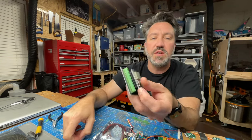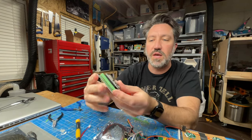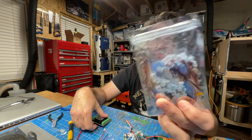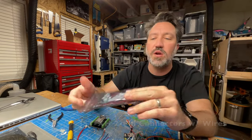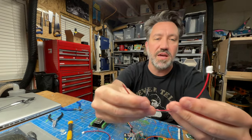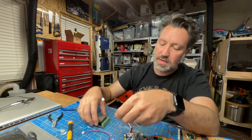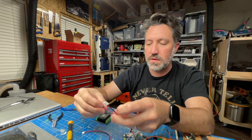The nice thing about this is you can connect to all of the various pins by simply using the screw terminals, and we're going to do exactly that. On Amazon you can get a pack of these — they are JST XH pins and pre-wired connectors, and they come in various sizes. You can get a pack of 10, pretty cheap. They're already got everything crimped, pre-soldered, pre-tinned ends, and those are going to fit right into our terminal shield.